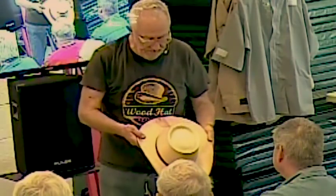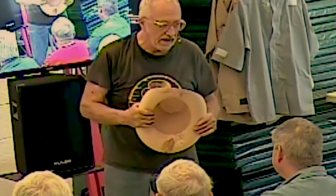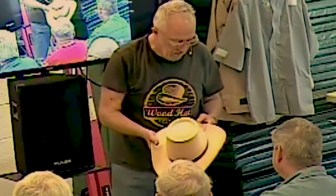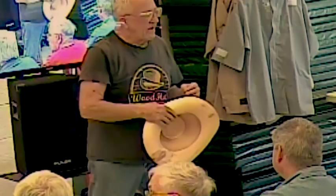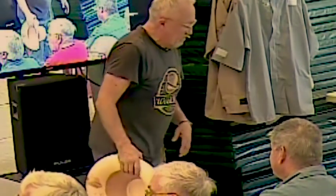But it's great wood for hats because it bends really well. So, and my big bandsaw is down right now, not working. Upper blade guide gone, finished, over. So I couldn't prepare the blocks on the bandsaw before coming here, which I would normally do. So we're going to do it with a chainsaw outdoors, which probably is a good thing because it makes it part of the demo. You get to see how I do it, so it comes out to be a nice, balanced, symmetrical piece of wood that you can put on a lathe that's not going to make the lathe dance.